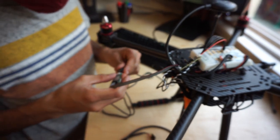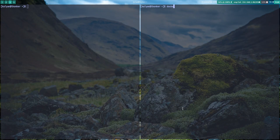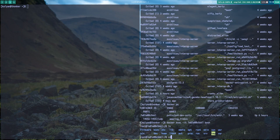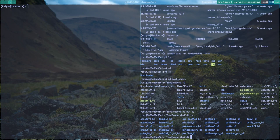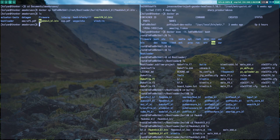You can then plug the debugger into your computer. The FMU K66 flight controller does not come with a bootloader flashed, so the first step is to obtain a bootloader binary. You can download a pre-built binary from the NXP documentation website, or build it from source. Here I am launching an Ubuntu Docker container where I have previously built the FMU K66 target for the PX4 bootloader. You can clone the bootloader source from GitHub — check the README and PX4 documentation for more information.